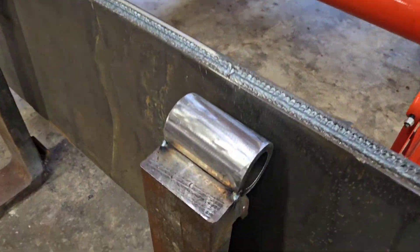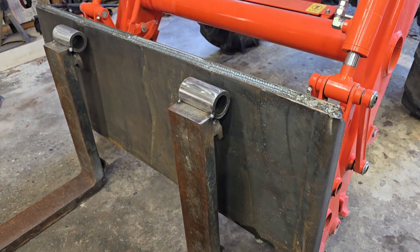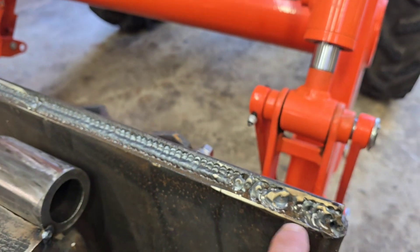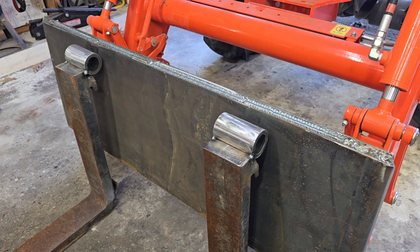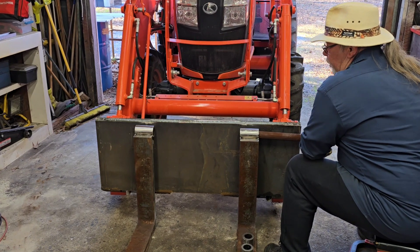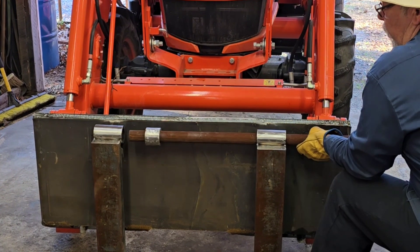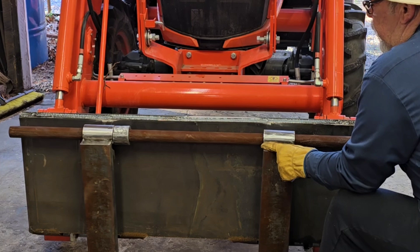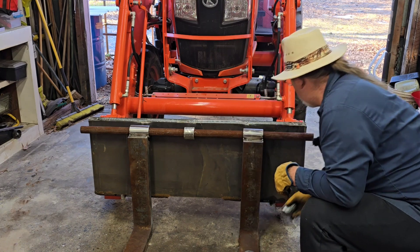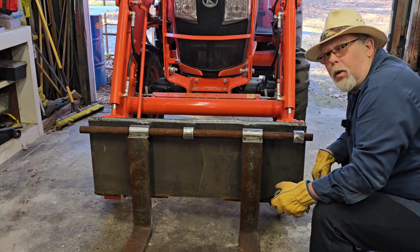I got both pipes tacked in place. Just so y'all know, that is not my welding across there — that's how this plate came straight out of, I don't know, China. We're going to see if we can do a little better job than all this undercut mess. Let's get this thing mocked up so we know where we're going to be. We're going to keep this as simple as possible. I'm going to take this back apart, clean this rod up, slide a pipe on right there. This is going to ensure that I'll be able to slide my forks back and forth and adjust them where I want. I'll be able to tack them in place on this plate, then take it all back apart and weld it up.